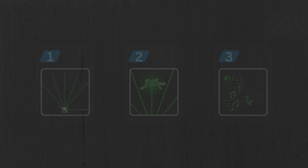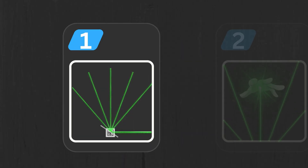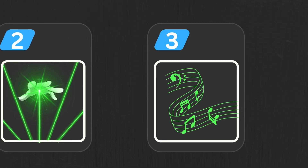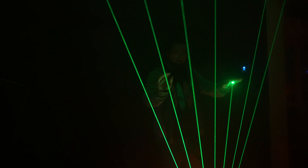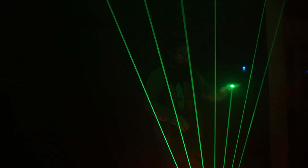This project is coming along nicely, but let me explain what's still ahead. Now that I've finished the visual setup, it's time to focus on making this harp actually produce music. To do that, I need to detect when each beam is interrupted and how high the interruption occurs. For true playability and polyphony, so I can use both hands independently, I need to precisely detect which beams are being interrupted.